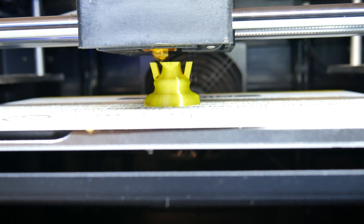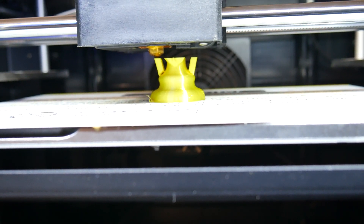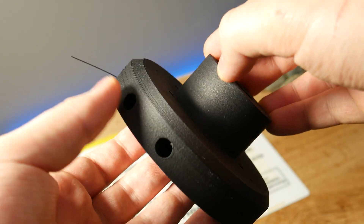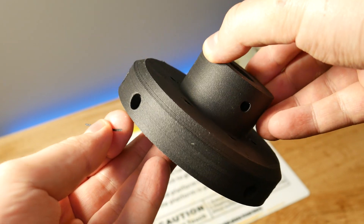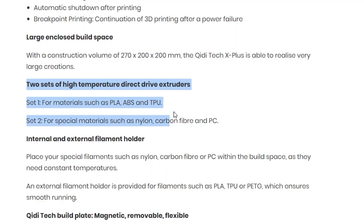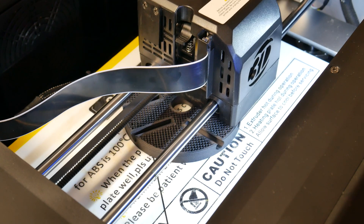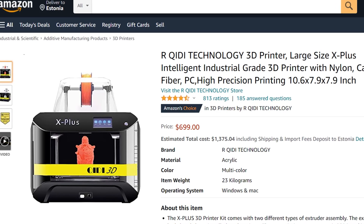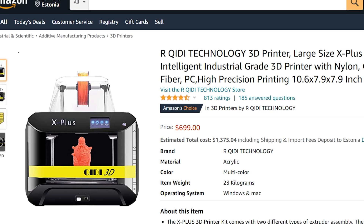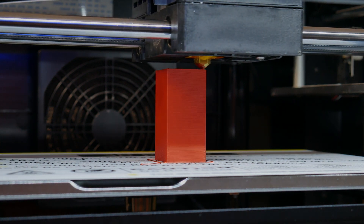So who can I recommend this printer for? If you're looking for a printer mostly for PLA and beautiful models, this printer will do the work — but you can surely find a cheaper option. But if you're looking for a workhorse that can print engineering materials such as nylon, PC, or whatever is out there, then this printer is made for you. From the box you get an extra extruder and hotend that can reach up to 300 degrees with a hardened steel nozzle, the print bed reaches over 100 degrees, and it's fully enclosed. This printer is also beginner friendly — there's no assembly and it's just so easy to use. It is worth the price. Thank you for watching and see you next time!